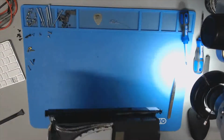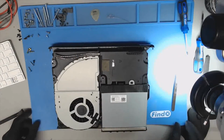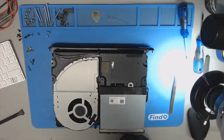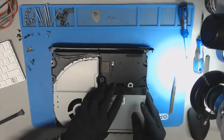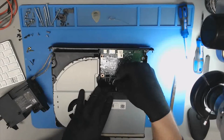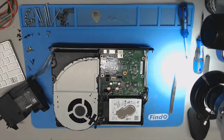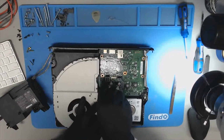Alright, so the symptoms were correct, their diagnosis not so much. So power's on, green light, makes that little chime that the Xbox consoles make, and the monitor TV detects no type of video signal. Wiggling the port doesn't do anything. There's not much give in the port. So I'm thinking we're gonna go ahead and take a look at the HDMI filter.